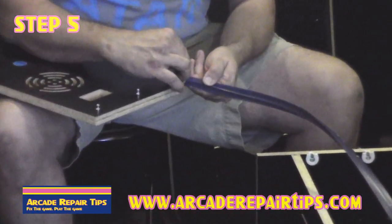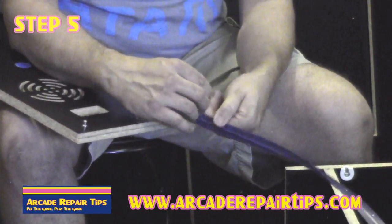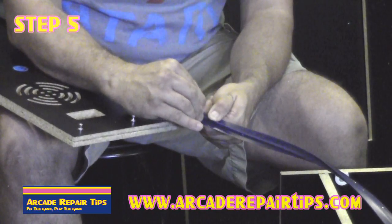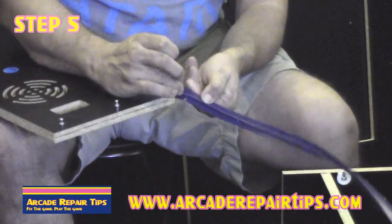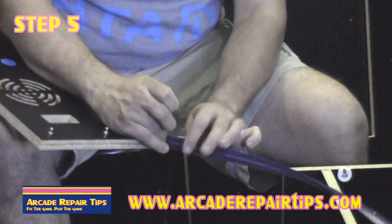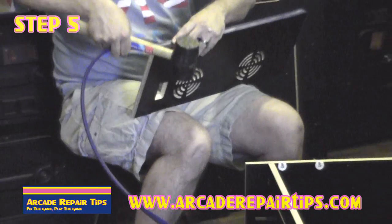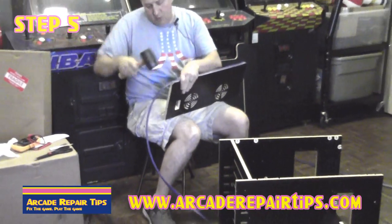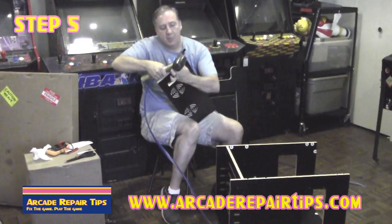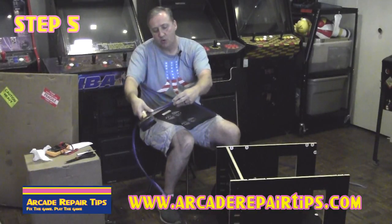So we're making these cuts. And what I'm actually going to do, you'll see this in your instructions about T-molding, is make a V-shaped cut right in that corner where the T-molding is going to go, and it'll actually come right out right there. Right here in the corner, that will help it go around that corner and lay a little better. So we're just going to keep going around that corner. There's where the V-shaped cut is, and that will help this to stay in there. Look at that, it adheres to that corner really good.